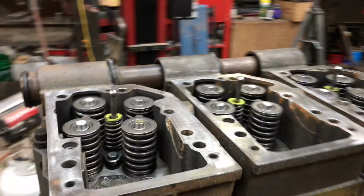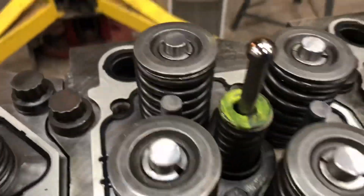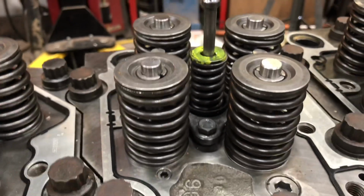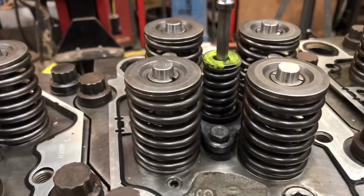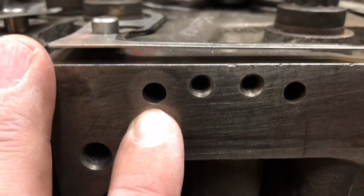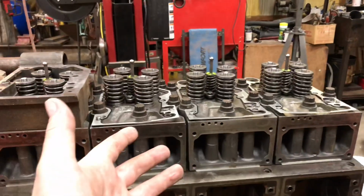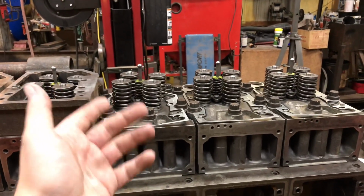Alright, we got all the injectors in. Got the injector push rod sitting in. Not too hard. You just have these two bolts. It slips right in. It's in its own little fuel gallery, so the orientation of the injector doesn't matter on this engine. These are the fuel ports. You've got either the supply or return on either side of these two little bolts right here. But it's getting where it's going to be done.